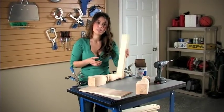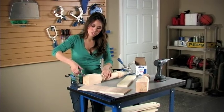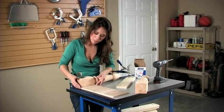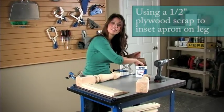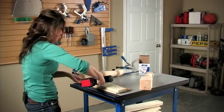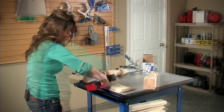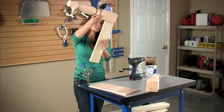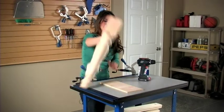I've got an end apron here. We'll start with the smaller apron — it's easier to work with — and a drill and some pocket hole screws. We're going to clamp the leg down. If you've got everything clamped and it's not going anywhere, that just makes your job so much easier and everything comes out more precise and even because if it's all clamped, you know that nothing's going anywhere. See that board moved a little bit — it's fine as long as you start it in the right spot. Just keep watching and it'll pull together really nice. We'll just flip it around to this side and clamp that.